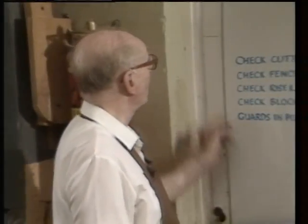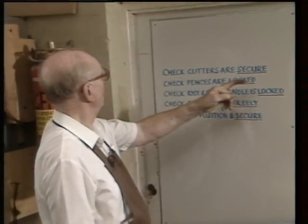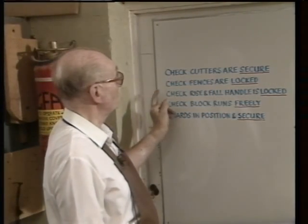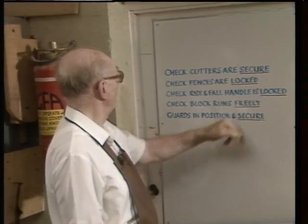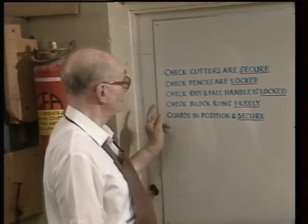Some people find the business of breaking through a little unnerving, but it's a practice well worth mastering. It's also a good idea to have a set starting drill. My cockpit drill is: check cutters are secure, check fences are locked, check rise and fall handles are locked, check block runs freely, guards in position and secure. All this takes only a few seconds and it is